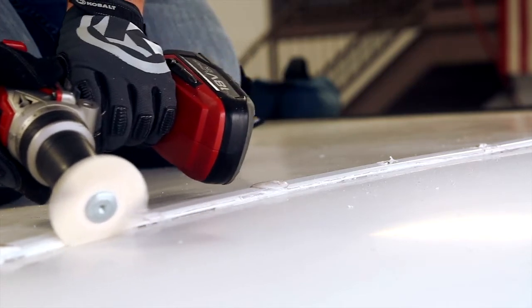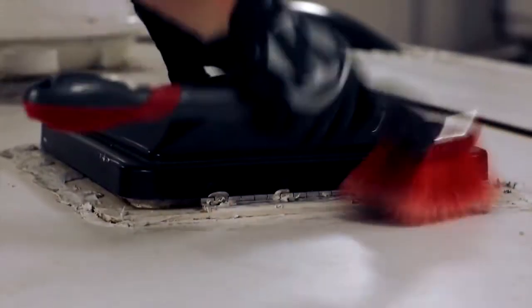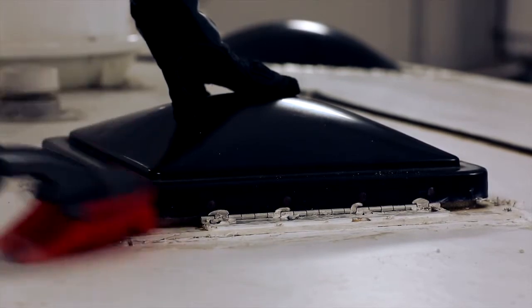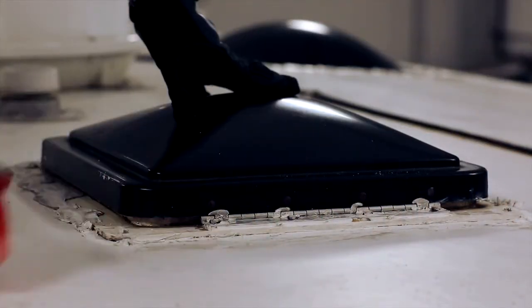Special care should be taken not to cut or damage the rubber roof membrane. Step three: remove old sealant debris from the roof area using a broom or industrial vacuum. Use a soft brush to clean around all vents and over the trim pieces to remove remaining small debris and dust. If you have an air hose, blow the entire roof surface clean. Now you're ready to apply the new sealant.